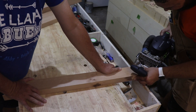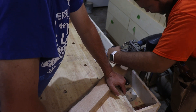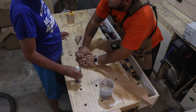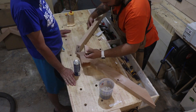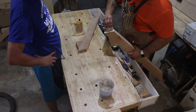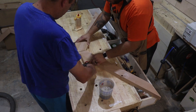Here I'm adding dominos to the peaks so I can do an easy glue-up for those two pieces. One trick I'd never used before that really surprised me: CA glue as a clamp for angled pieces. I put CA glue on, added regular glue and dominos, then one clamp — and got a perfect glue line. I didn't think the CA glue would hold, but it did. At the end I just popped it off and moved on.